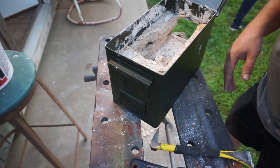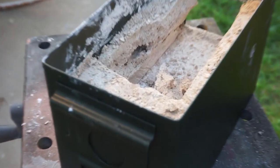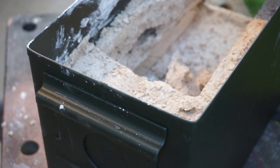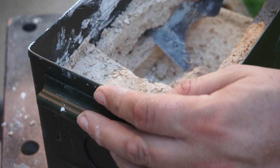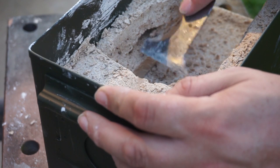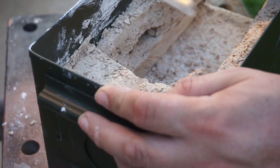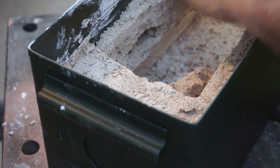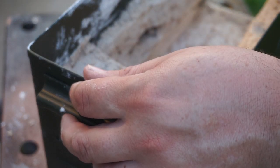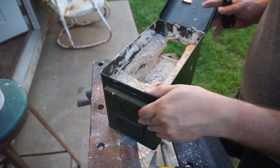See, and then we have areas like this right here. This is why this stuff ends up failing real easily, because you try and get it packed down, but you end up with all of these little gaps and open areas right here. This wall would have cracked real easily right there. So, yeah. I was gonna try and keep some of the side pieces and just end up trying to do a brick on the top. Nope, all of these side pieces have gotta go, so yeah. We'll go ahead and keep removing stuff.